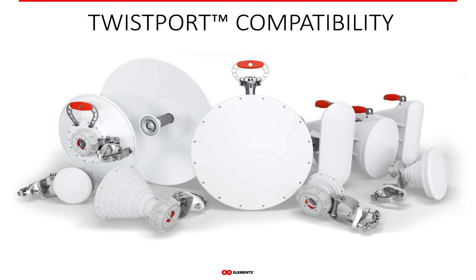Sometimes it is unclear to customers whether they need to buy a new adapter for every new or different RFElements antenna working at 5 GHz — the answer is no. The size of the Twistport is the same among all antennas we already have and all future antennas we might develop. This protects your investment. The backward and forward compatibility ensures you can use our antennas with different radio platforms. If you decide to switch to a different radio vendor, simply change the adapter to fit the radio you want to use and keep using the antennas you already have — no need to buy new ones as you migrate your network.